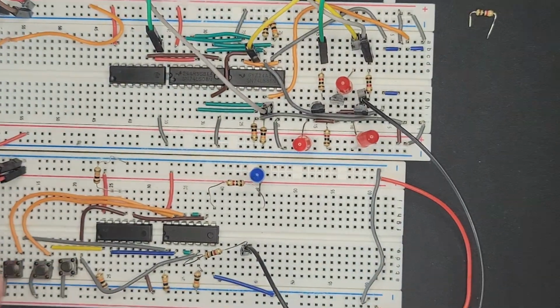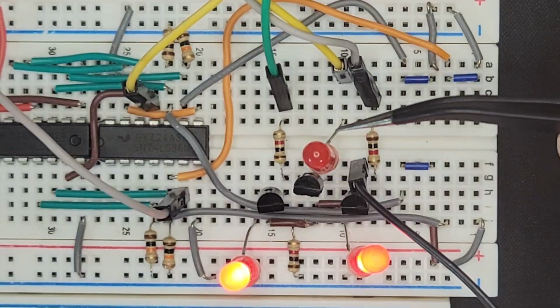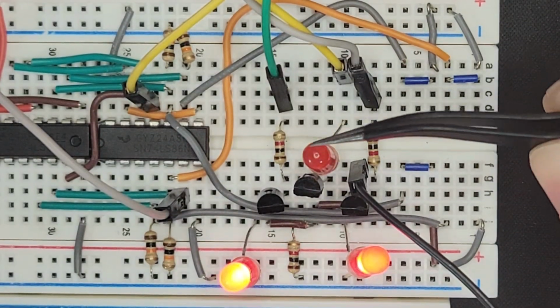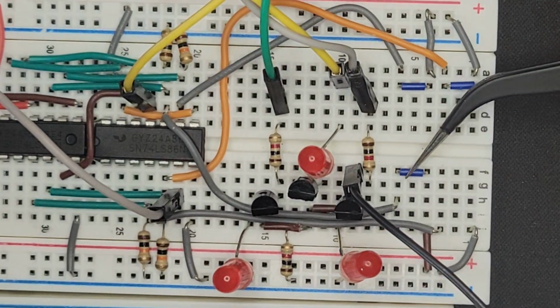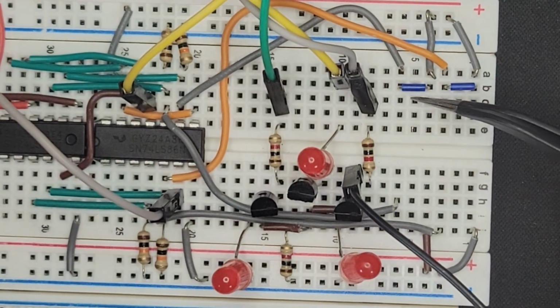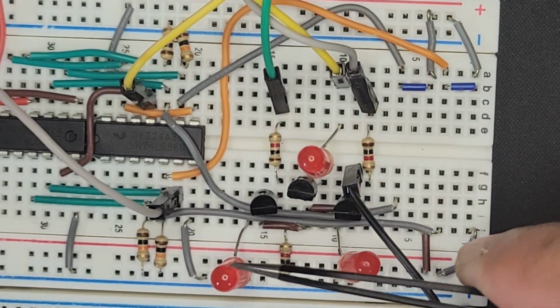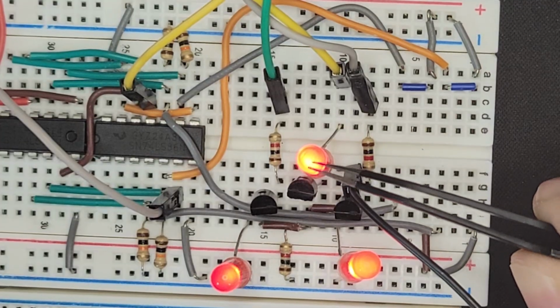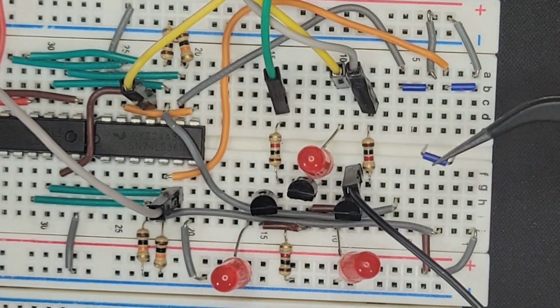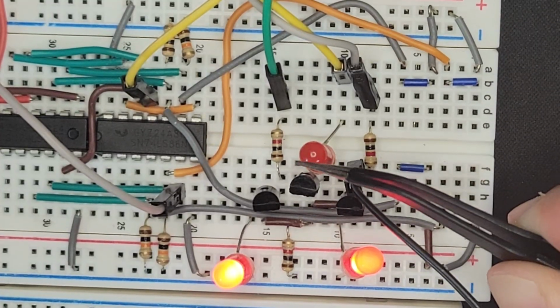Okay, I think this worked. I think putting the LED first does seem to work, because we can see now he's the only one that kind of has this smart feature who will actually output the correct bit. And you can see that when I turn off this bit here, and now it's just 1 1, which makes 3, and 0 0. So we have a 3 signal, so it should be 1 1, and this should be off. And when we put back in the 2-bit to make it 5, so 1 0 1, he's acting as he should.